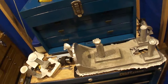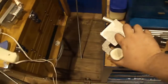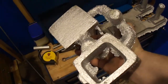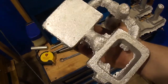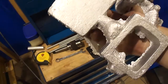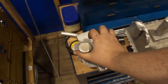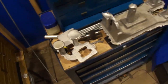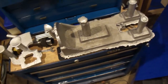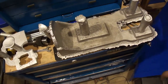I wanted to have the shrink bob on the bottom of this one so that I can machine it off. It'll create a big blob there because I'll machine it down and create a spot for the steam inlet plug to come in — or I'll just machine it off and put it on that way. This has a lot of flashing around it because I kind of had to get creative with the mold.